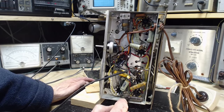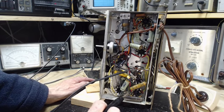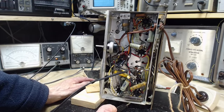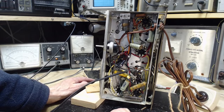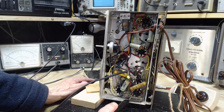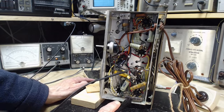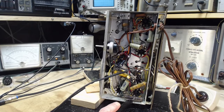Okay, so to explain what I'm mumbling about, this radio, according to its own information, has a 35L6 for an output tube, but what's actually plugged in there is a 50L6. They're the same tube with different heater voltages. This resistor makes the 35L6 work. 50L6 is not enough voltage available in the radio to get 50 onto the heater here, if all that thinking is correct.